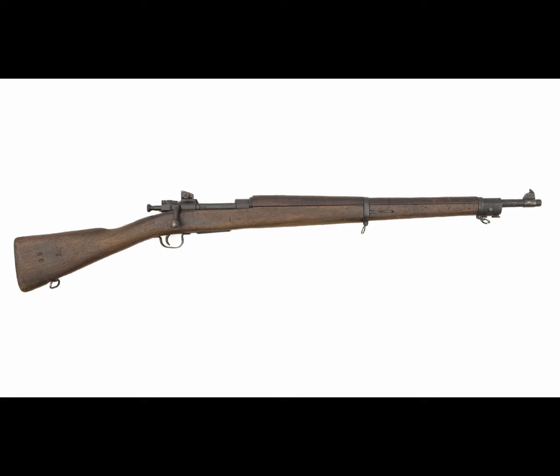At this time, Springfield Armory was focused on manufacturing the M1, so future production of the 1903 was given to Remington Arms and Smith Corona Typewriter Company — yes, a typewriter company was making firearms for the U.S. military. Some rifles were made with scant stocks while others had the older straight stock. The most notable change was to the rear sight and handguard: to simplify machining, rear sights from the M1 carbine were fitted to the 1903 receiver instead of on the barrel, so the wood handguard would cover the entire barrel. These rifles were dubbed the 1903 A3, or O3A3, issued to troops behind the lines to free up M1 Garands for front-line use.